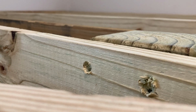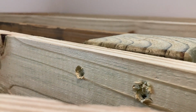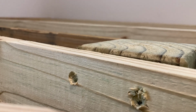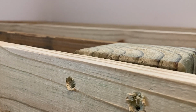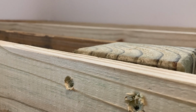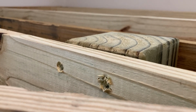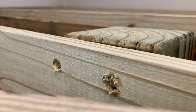And then I had one where, in the star drive head, there was some kind of flotsam or jetsam in the head of the screw, and so those got tossed. And if they start to strip, or you think there's even an inkling that it might have stripped a little bit when you put it in, go ahead and back it out, throw it away, and get a new screw. Why do we use star drive heads versus a Phillips? So the star drive, the bit just grabs better.